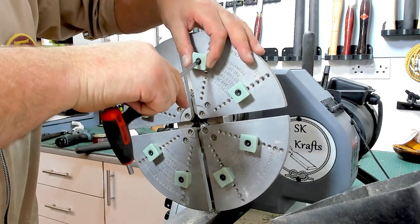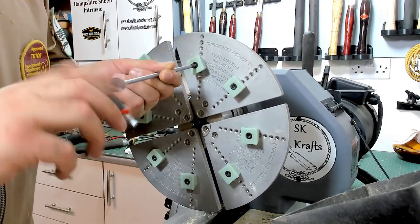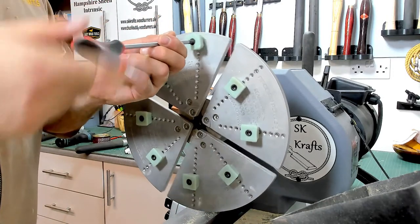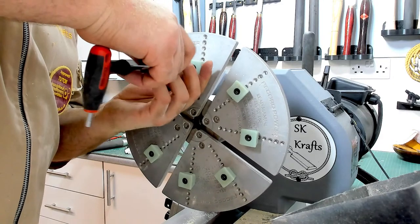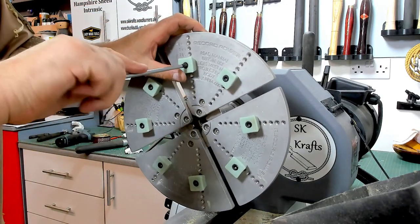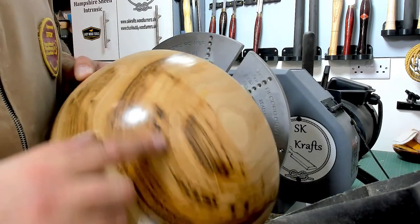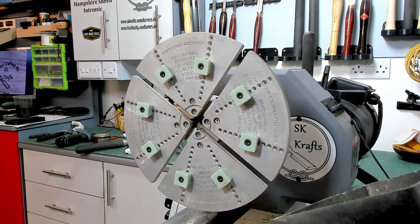I have got a disc. I did make a disc with a soft mat, but to be honest, I got put off it the other day. I had a nice cherry bowl that I had a tenon on for a long time, and Chloe, my oldest daughter, wanted a fruit bowl. So I said, "Oh yeah, all I've got to do is turn the tenon off and I'll do it for you." So I made this platform, put the matting on it, let the matting dry, came in here, put it on the machine, and turned it on. I got carried away with the tenon. The tenon snapped, the stub snapped, and it threw the bowl across the workshop. Now I've got a bowl with no tenon on it and chunks out of the side. It's now got massive gouges out of the side, where I've got to find a way of refinishing it. But the bottom turned out lovely. Anyway, you learn by mistakes.